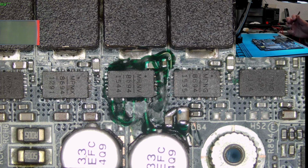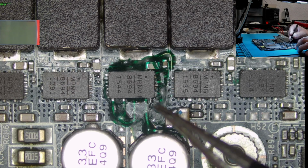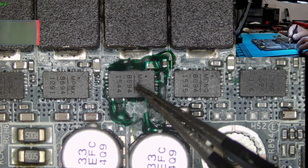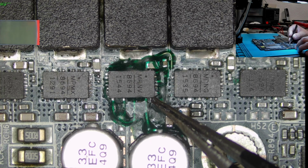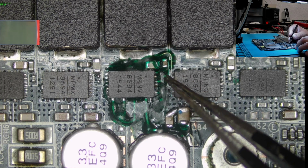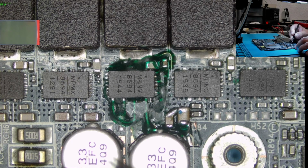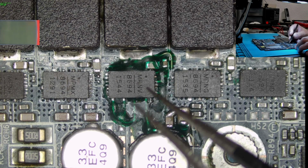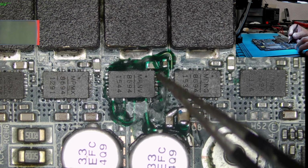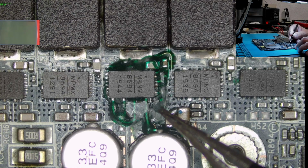However, this is how it actually looks. Just look yourself. I'm so excited, so happy about this job. Everything went very well. This sits perfectly fine in its place. I have added a few capacitors for bootstrapping on the main power rail here and here, and also replaced the big capacitors here, and covered the exposed tracks here again with the UV mask.